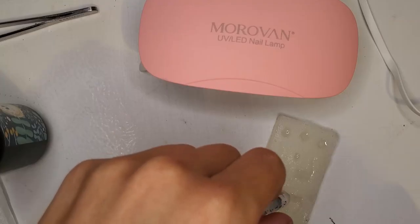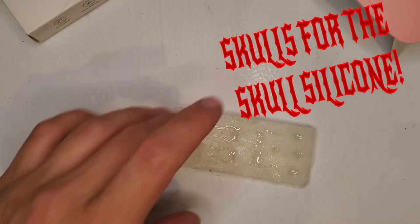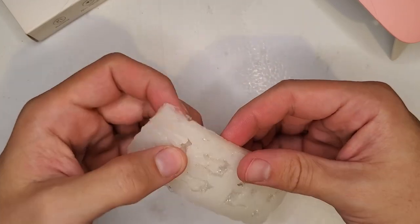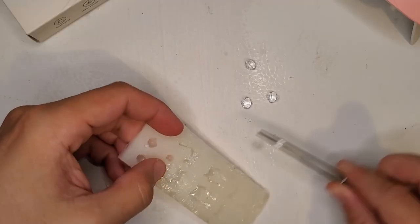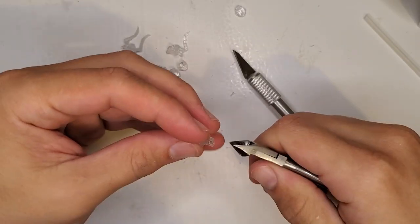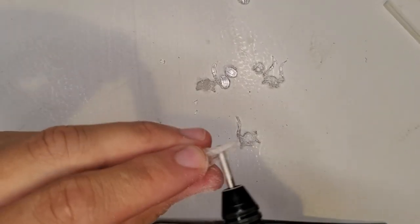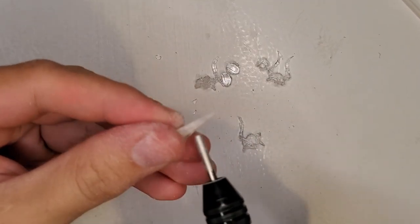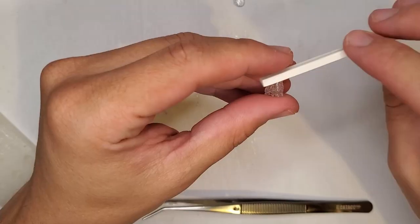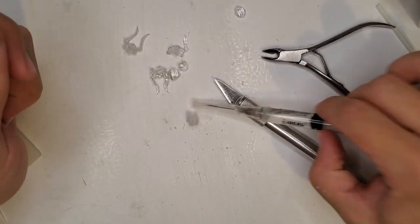In the case of UV resins and two-part epoxy resins — like the five-minute epoxies you get at the hardware store — it's a simple matter of just pouring it in. In both cases, you can use isopropyl alcohol to thin out the mixture to make it more fluid and get a cleaner pour. UV resins tend to be harder and more brittle, while two-part epoxy resins tend to be a little more rubbery. Because I did not have the proper tool on hand, I kinda splashed the resin in there rather haphazardly, so now I'm paying the price laboriously removing all the excess resin flashing. Certain resins are pretty hard once set, so if you do have cleanup to do it's gonna take you forever — best just to avoid it and only put in as much resin as you need. Apply it carefully so you don't overfill and end up with trouble.